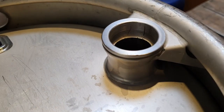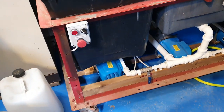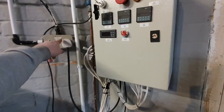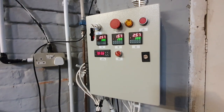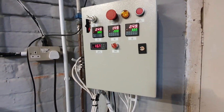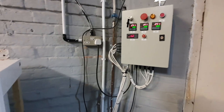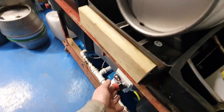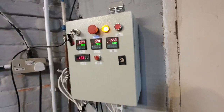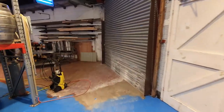Clean, sparkly casks — Gemma's been cleaning them yesterday. We've finally recommissioned the cask washer after its redesign, and the control panel works wonderfully. She's got the times set: three minutes for the caustic wash, a two-minute rinse, and a three-minute acid wash, with the caustic tank sitting at 60 degrees centigrade. Let me check the emergency stops are all pushed in, then we can start the interlock and the caustic heater will come on, ready for when Gemma arrives.